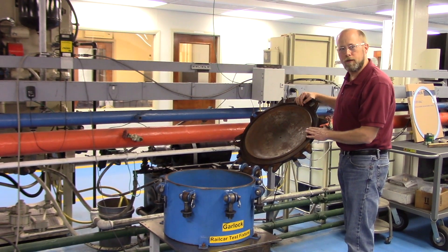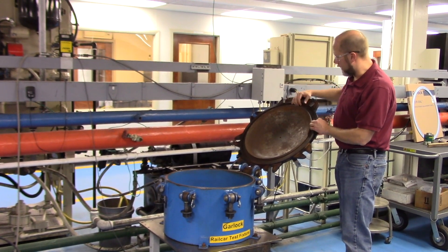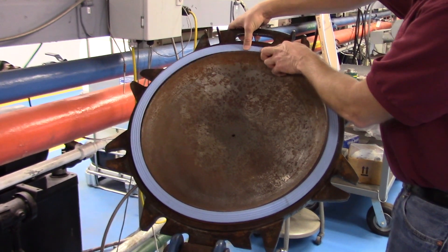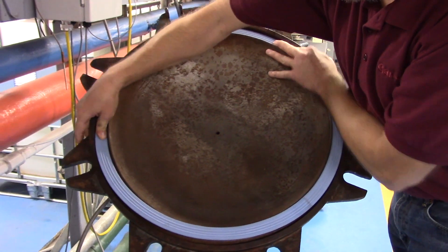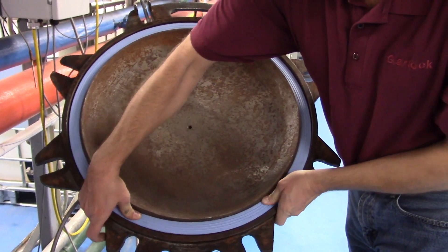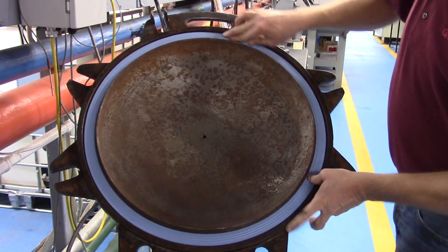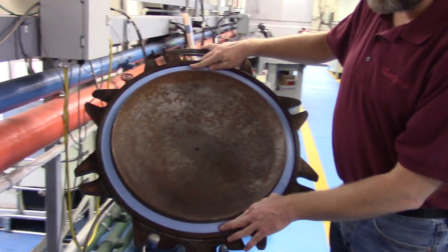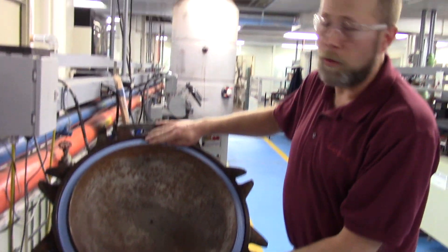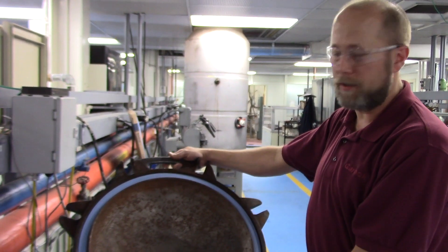An AAR-1 manway has a dovetail type groove in it which is designed to hold the gasket in place when it is used. With the manway installation, you simply put the gasket in place, press it down, and slide your fingers around the assembly until the gasket snaps in. And unlike traditional rubber gaskets, the tough rail gasket is rigid enough to actually hold itself in place and will not fall out during the installation process or during the actual opening and closing of the manway.